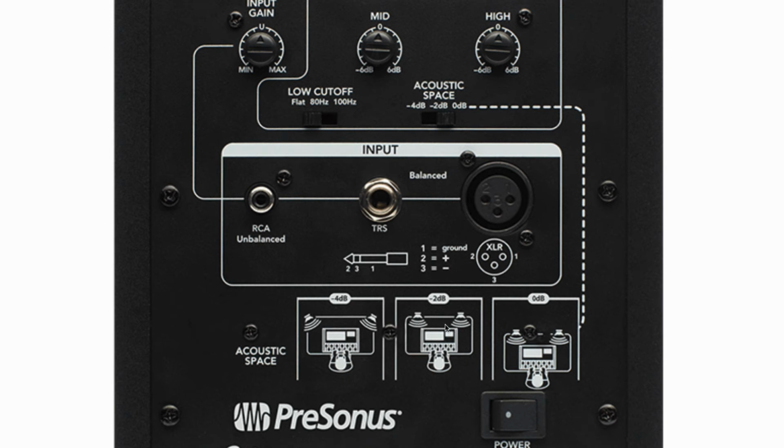In the second picture, the speakers are against the rear wall but not in the corners. Doesn't mean that your speakers are as close to the wall as it shows in this picture, but they're not in the corners is the point. But they are against the rear wall. Well, in that case, again, you put a bookshelf type speaker close to a rear wall, you will get bass boost. So in that scenario, you've got the option to roll off the bass end by minus 2 dB, just a little dip, just to compensate for that bass boost that you're going to get by having your speakers close to a rear wall.